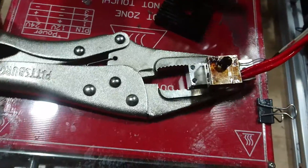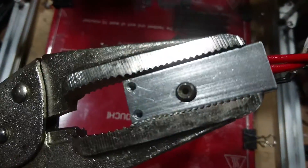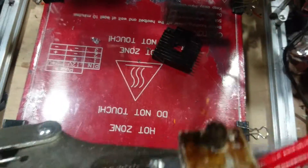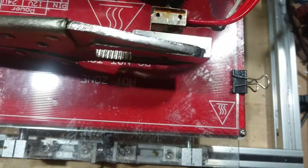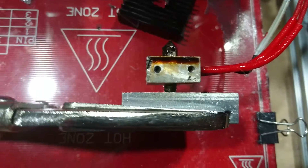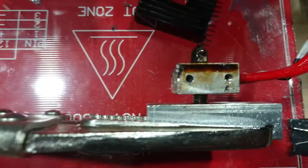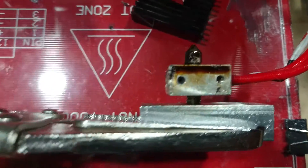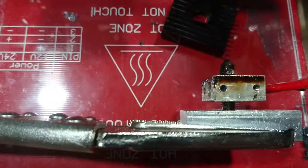Here's my hot end - it's an ugly mess. I tried cleaning it off and getting most of the old piece of filament out and I'm still working on it. Essentially what I've got to do is push a rod in there, a drill bit, and try to clean all that out. It seems like it's jammed - I'm guessing because of all the steam that was in the PLA, it ended up clogging the nozzle when it cooled down or something.